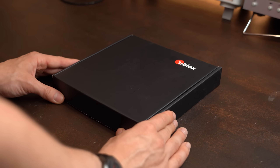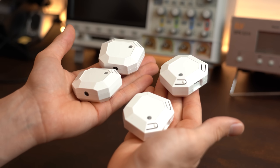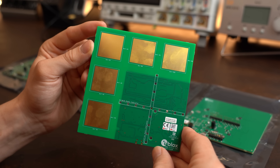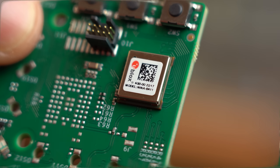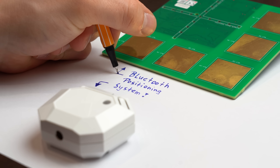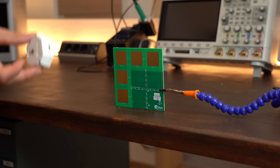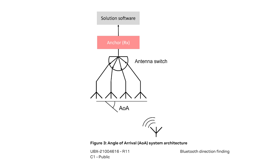My personal highlight is from uBlox, which after unpacking comes with 4 identical big PCBs and 4 smaller white boxes. The big PCBs look impressive with their lovely traces and 5 antenna pads on the back. The small PCBs inside the white boxes are built around the NORA-B406, while the big PCBs are built around the NORA-B411. Both are Bluetooth 5.1 modules used together as an indoor positioning system. The antenna boards can determine where the tracker boards are located by using angle of arrival technology, measuring the phase shift between the different antennas.